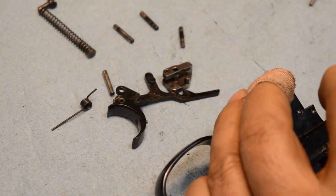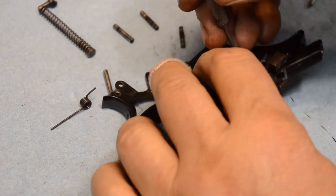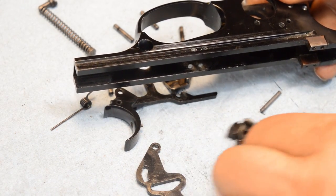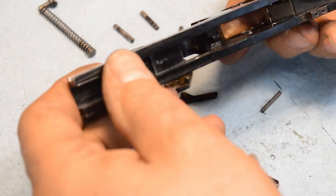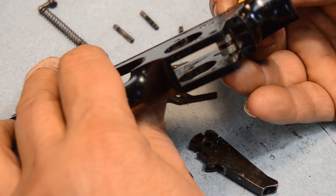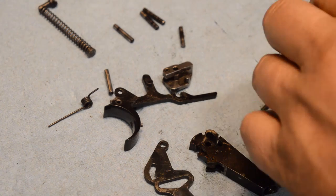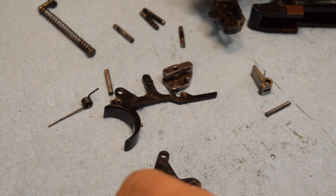I'm trying to get out of this thing in a way that I stand a fighting chance of getting back into it. We push that the rest of the way out — this is still trapped — lift this up and all of that comes out in one great big piece. This pin was sliding up and down inside that slot around the trigger pin. Then the only thing left is the actual sear, which is spring loaded. We'll push it out on another identical pin — there's the sear. We'll line all this up so you can see it all.